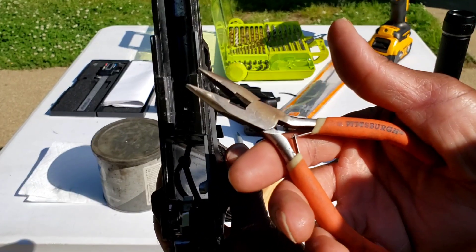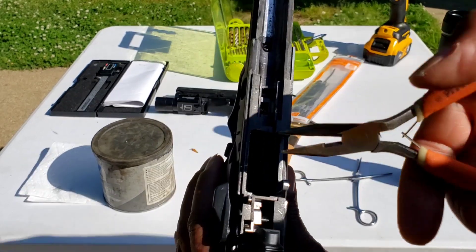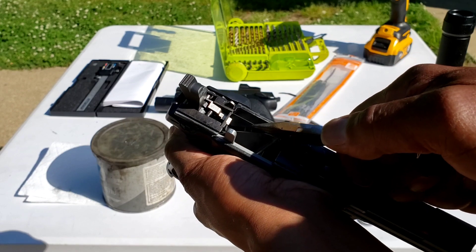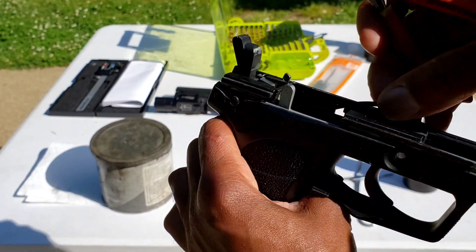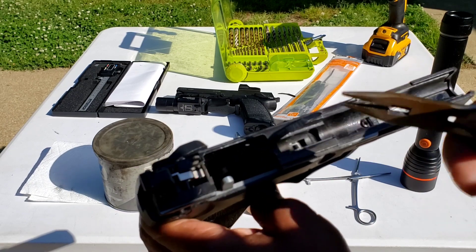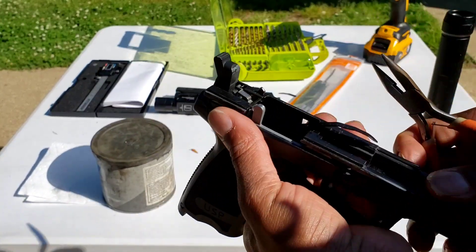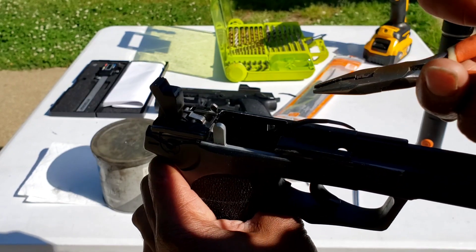I finally got it threaded in there — using both hands, holding one end with one tool and the other end with another, then threading it. Once threaded, I can grab it and pull. The important thing here: you only want to pull until it stops. You don't want to put tension down on it — just hold it in one position. Don't pull it tight enough that it's actually pulling down on the frame or you'll have issues. If you're still having problems after this mod, you've probably pulled it too tight.